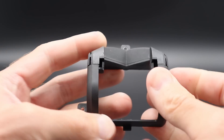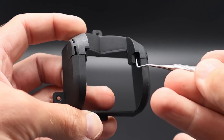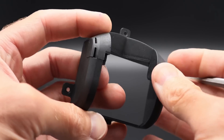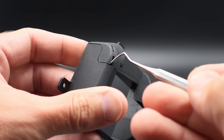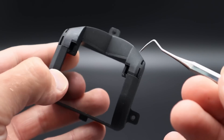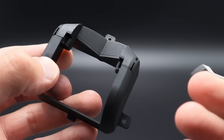This is the stock duct and it does not make much sense to me. We have air only coming from the back, set slightly to each side of the nozzle, and then there are these strange relief ports which send air away from the parts. My best guess is that this was done because the fan at 100% was sending too much air from the back and causing quality issues during testing. This works, but I think it is too restrictive and too noisy and I think we can do better.